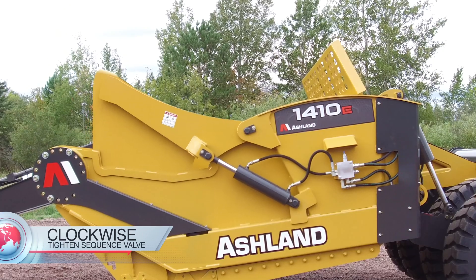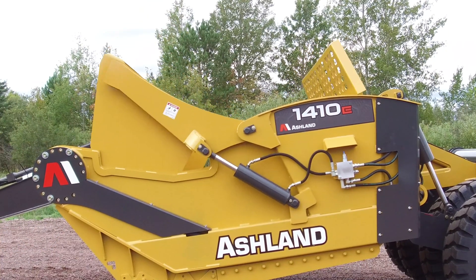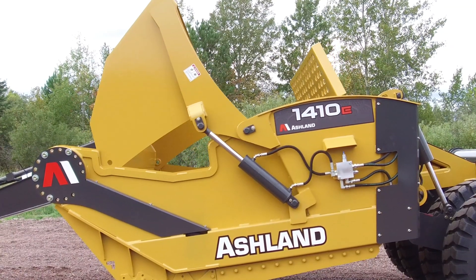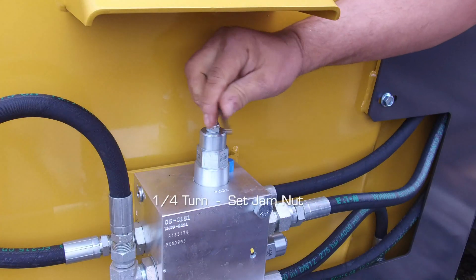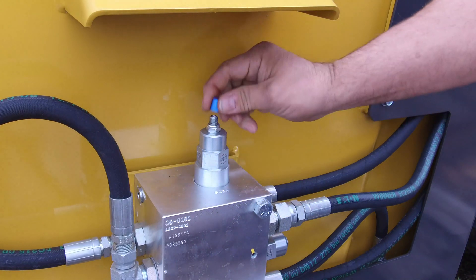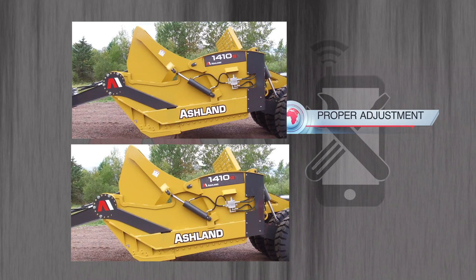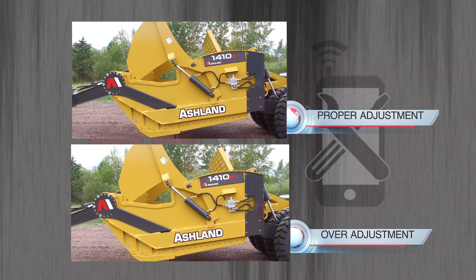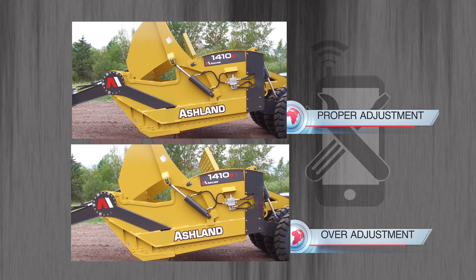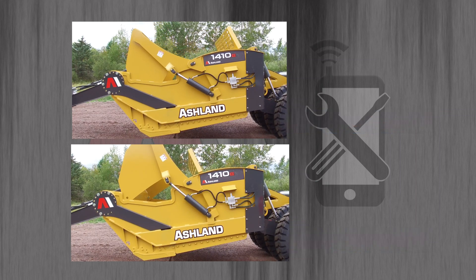Have the operator repeat the opening to ensure the setting is good. We recommend adjusting the screw one quarter turn more before setting the jam nut. This is the most important setting to ensure the fastest ejection speed possible. The top screen shows a properly set sequencing valve, whereas the lower screen shows the slowness of an over-adjusted sequencing cartridge. We are simply trying to find the lowest pressure setting needed to open up the apron first before the oil diverts to the ejection cylinder.